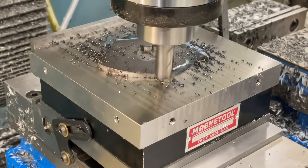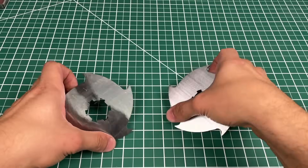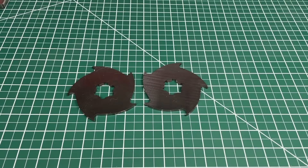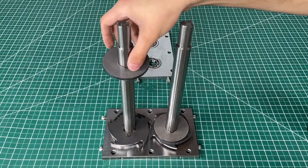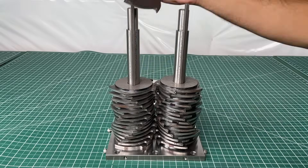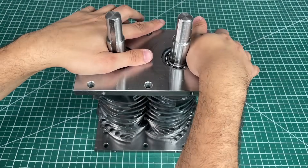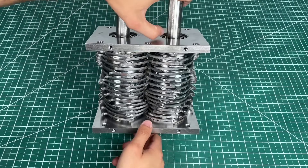For the sake of this video we also ground these 32 blades, which was totally unnecessary, but I can't think of why added precision would hurt. We install the spacers in an alternating fashion onto each shaft, and after mounting these components, we cap Shreddy off with the second bearing plate, leaving us with this beautiful array of cutters. It looks very promising.